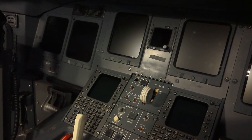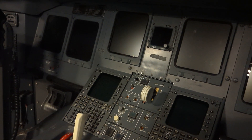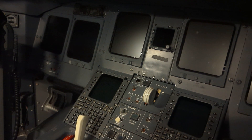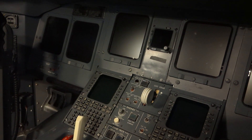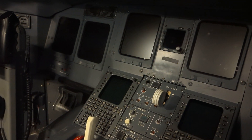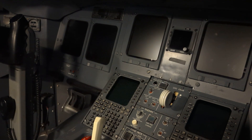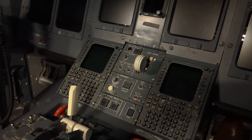This is the Endeavour Air electrical power-up procedure for the CRJ-900. I've already confirmed that all circuit breakers have been checked, and the MMO-1 logbook has also been checked to make sure there are no existing write-ups that prevent electrical power from being applied to the aircraft, and the maintenance and progress book is not being displayed on the center pedestal.